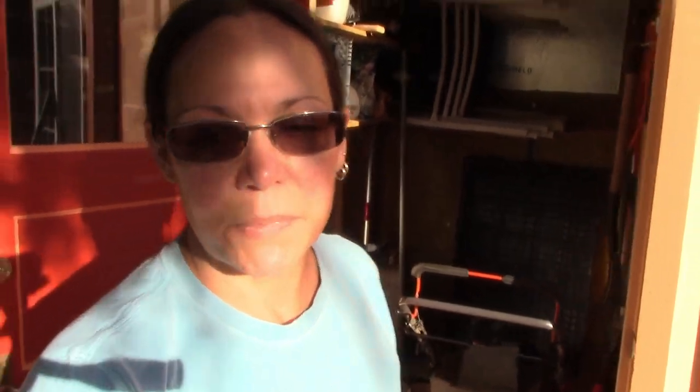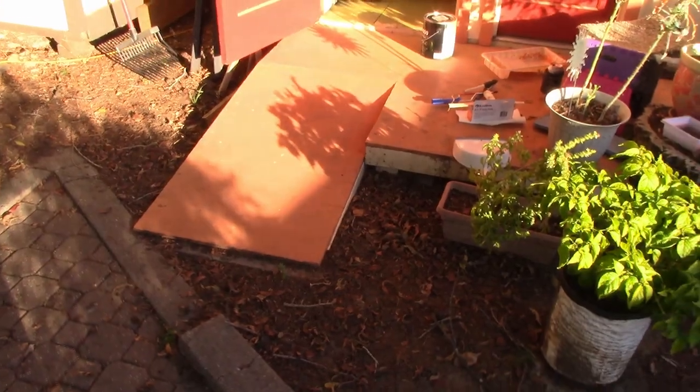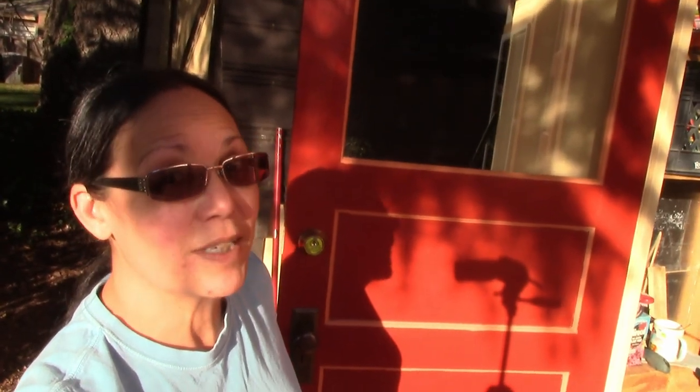I've got a ramp over here in order for me to roll the lawnmower up there, so I didn't want it to become slippery. Let me show you up close how the texture of the porch is kind of grainy — that's the sand. I didn't put a lot, just enough to where I could mix it into the paint pretty easily and have a non-slip surface. If you want a non-slip surface, that's a really cheap way of doing it: just put a little bit of sand in the paint, mix it in good, and paint it on.